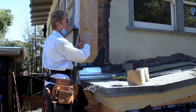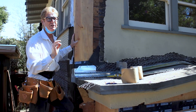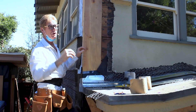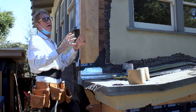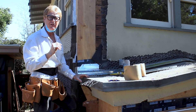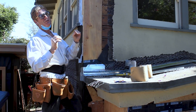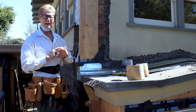But if they had painted this house, or any other house in the USA or in the world, every ten years, it'll last forever. But these saddles — or if it didn't have a saddle — what happens is the sun hits it, it bakes it, it expands the wood just a little bit. You can't see it, but over 50 years, that expansion creates a tiny crack. That tiny crack, when it rains, water gets in it, swells the wood, the wood expands — thus you've got your crack forming, and over the next ten years, that crack that's two stories high, you can never see it.